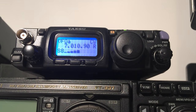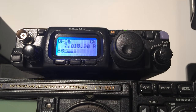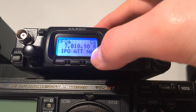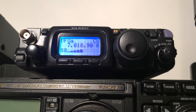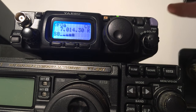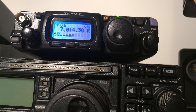So let's find a QSO and show the filter actually working. Here's a CW QSO in progress. As you can see I've got about S8, S9 noise, which is not very good. If I switch in the filter, that immediately just sounds so much better. We're on 7010 kHz and I'm going to show that it does actually cut off fairly well. I've found someone calling CQ — we're on 7014.3 kHz now — and it sounds a lot better with the filter switched in.